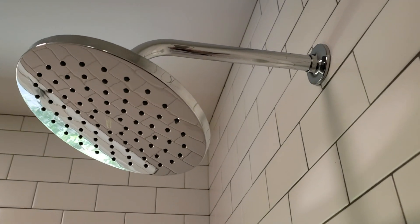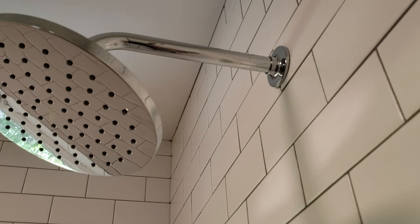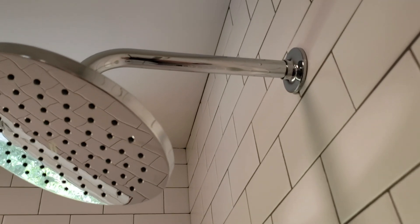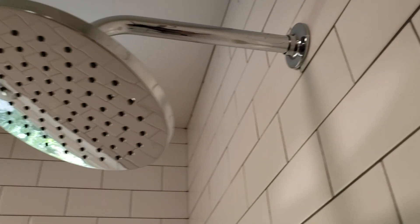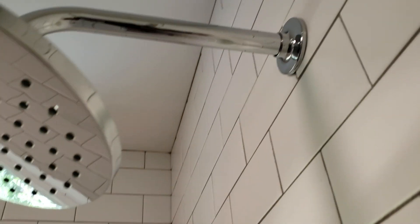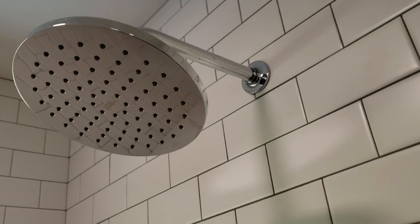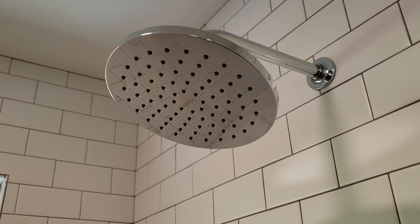We're not turning the shower on right now because there are no shower doors in yet. The rain shower head is in — we've got a 90-degree elbow in the wall. With this long arm, I'd recommend not moving it around much at all. When you rough in the plumbing up there, you have a galvanized or brass nipple stubbed out with a larger outside diameter than the tubular arm, so once it's in the hole there's less support and it'll move. Don't hang things on it or bounce around — just find a comfortable position and leave it.